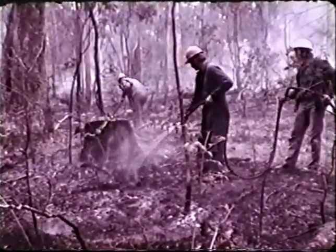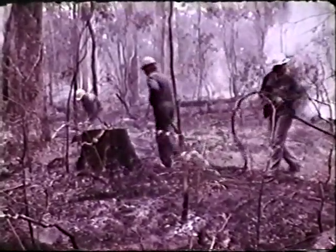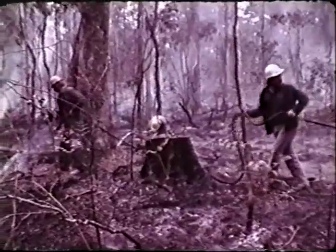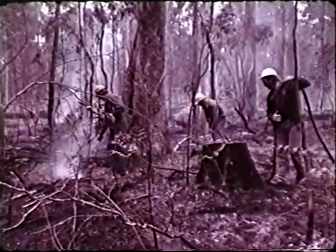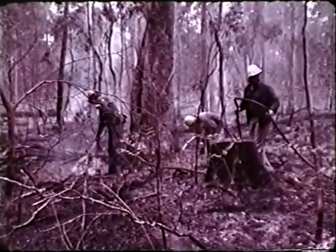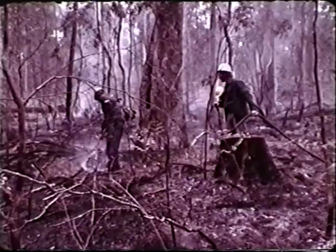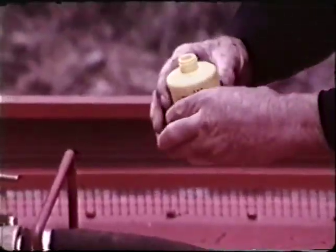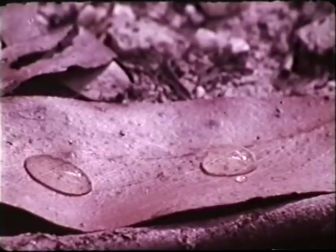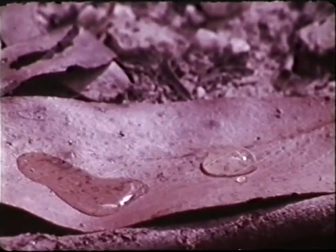This gives you time to assess the effectiveness and saves water. This is important when working from a tanker, because you must constantly assess your rate of use and know what's left, so you won't get caught without water when you really need it. Water tends to remain as droplets due to surface tension, but with wetting agent added, the same quantity spreads over a larger area. Thus, wetting agents can be useful to increase the effectiveness of water.